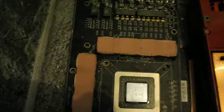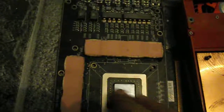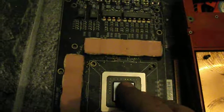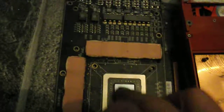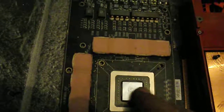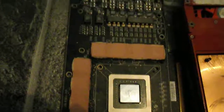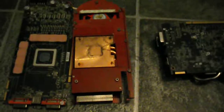The only thing I've seen that works as a more permanent fix — like what Apple did, though that was just a solder joint problem — is putting a bit of rubber on top of it to press it against the case and put pressure on it. That actually does work to an extent, but it is a complete bodge and you should never do that and then sell a graphics card knowing you've done it. Let's not go into that too much, but I have seen it done. That concludes this video on the damaged graphics cards — thank you for watching.